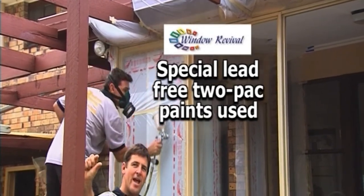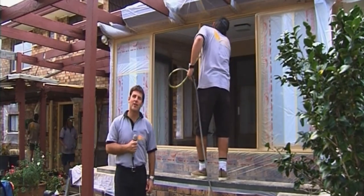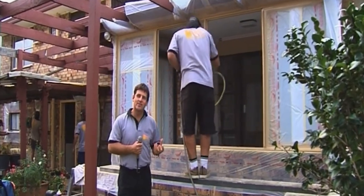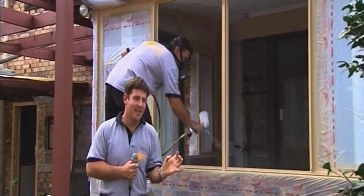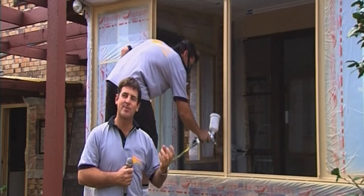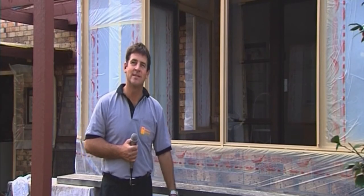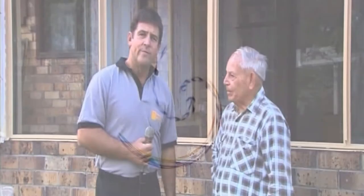Jamie's putting the final coat on now. The trick to the final coat — and this comes with lots of practice — is that we want to put it on as thick as possible and as smooth as possible, but take it to just where it's about to run but it doesn't, so it's just sitting there. That's the art of spraying windows, because when people come over to look at it, it's like thick plastic. That takes practice and we can show you how to do that. If we learn the right way from the beginning, step by step, we'll have a successful business and you'll be a proud owner of a Window Revival business.